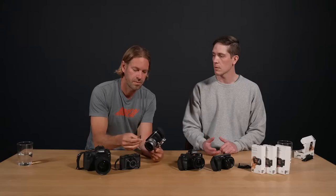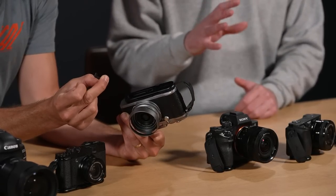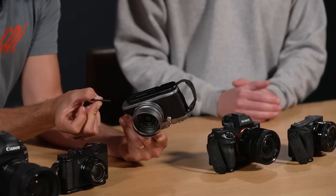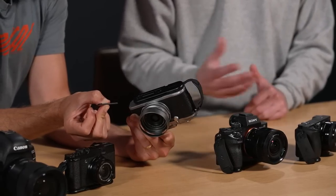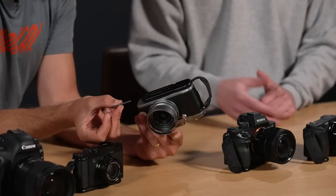For a lot of the integrated tools that are magnetically stowed within products, we use a process called metal injection molding, which allows us to get really high resolution, basically any conceivable geometry that can be injection molded in very high hardness with special alloys if we need them. And that's found in the tripod, the mobile tripod, and it's also found in this product here.